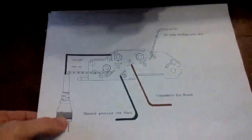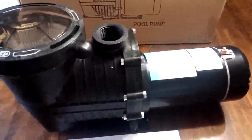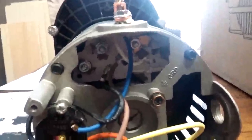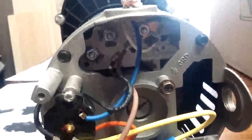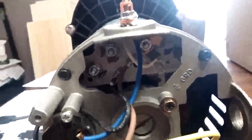Just to give you an idea of what comes with the pump — you get a little diagram of how to connect the plug. Some people complain about there not being a switch on the pump itself, but I've always had to hardwire it to a switch anyway. It gives you two different wiring diagrams, and you also get a handy little user manual with specs and how to wire it. Right in here you can see the different posts and compare to the diagram — it's a pretty simple setup, not that difficult at all. Even if you're not an electrician you can do this. Just make sure your breaker is turned off before you hardwire anything.